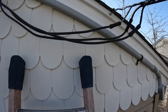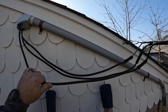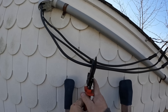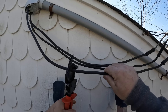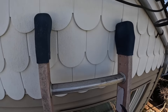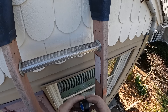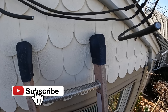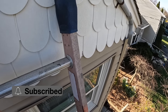After I kill all the circuit breakers and remove the meter so there's no electrical load on these lines, I'm using my Klein ratchet cutters to cut the existing service entrance conductors. The service conductors from the service drop are a little short, so I'm going to reuse some of the existing wiring in place.